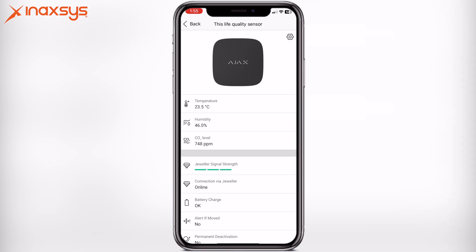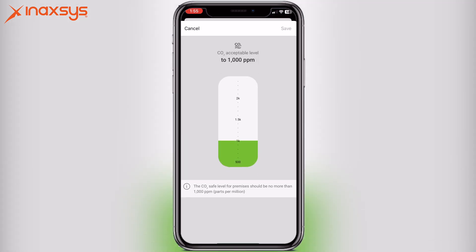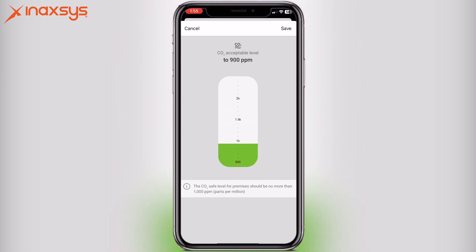When I click on the upper right-hand corner, which is the programming, I can then set the air monitoring settings. For example, in the CO2 level, I can click on it and set it to go into alarm if ever the CO2 level goes above 1,000 parts per million. I can change this as needed. As I increase the level, it's going to increase the type of alarm. At 1,000 parts per million, the air quality is still good but is on the verge of getting a little bit worse.